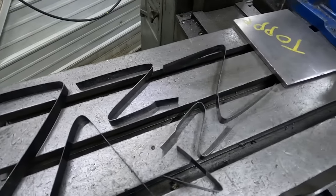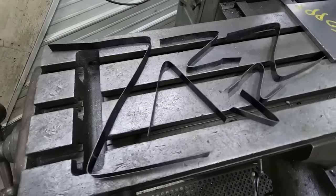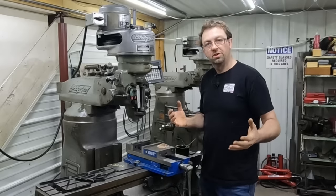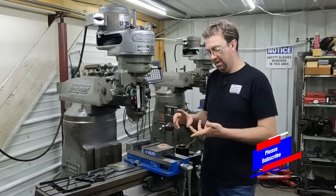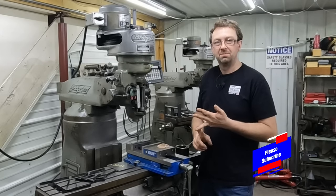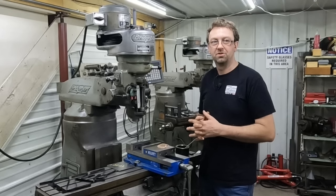I have several different sizes I've made over the years — I just hang them up on the wall with my collets. If they fall on the floor and you lose them, no big deal, just go cut another piece of banding. In over 20 years in this business, that is the best method I have found to keep parallels in position. It's free, it works effectively, and it's readily available.